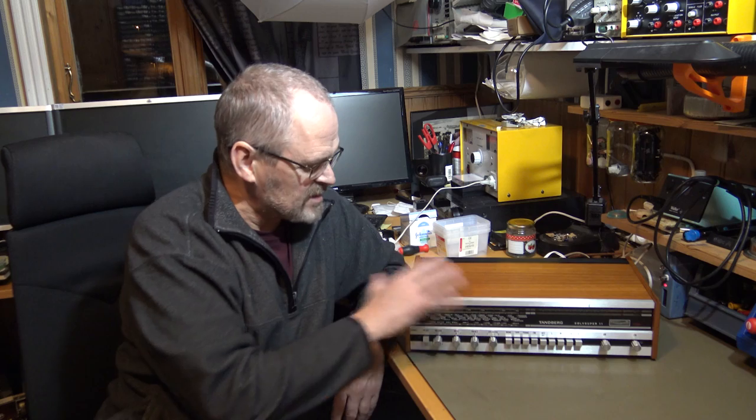Back to the question from the beginning of this video. If it would fix. Yes, it would fix. It was a little more complicated than I first thought. As you remember, we were replacing the output capacitors, one of them was shorted. It was two transistors, and I chose to replace all the capacitors in the power amplifier. Now it's playing great. It looks great as well. I've been cleaning it, giving the wooden details some Chinese wood oil, and it really shines.